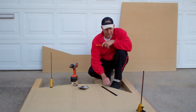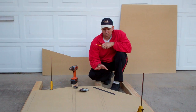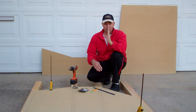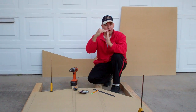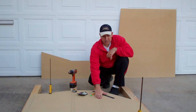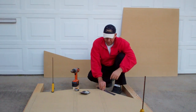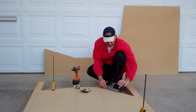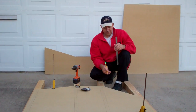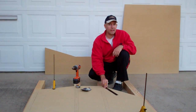From the outer side, if you remember in an earlier video, I said to cut this an eighth-inch to three-sixteenths-inch thicker because you actually want your side wall frames to penetrate up and over the top and the back frame. So your wall frames here are going to come up and actually come over what's going to be your top skin. These distances here are actually an inch and five-eighths instead of an inch and a half. These interior frames and the back frames are an inch and a half — that's what these lines here are. So your three-quarter inches here on each side — three-quarter and three-quarter — and then on this side, you want to measure over from the inside three-quarter so that you know you'll hit the exact center of your two-by-four. I've basically done that now, just making little V-style hash marks all the way around the perimeter to mark out where the center lines are.